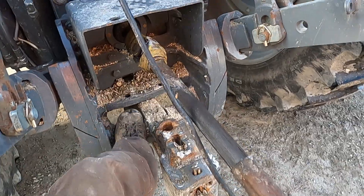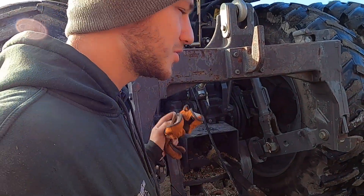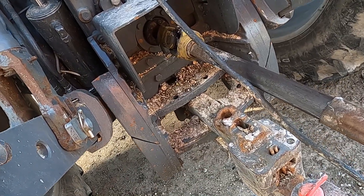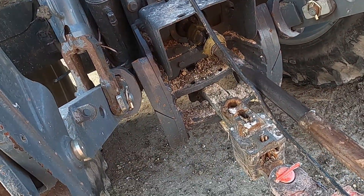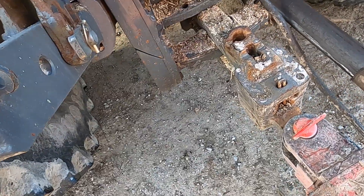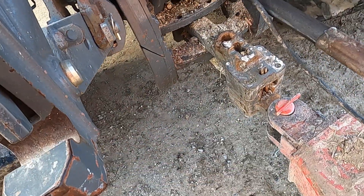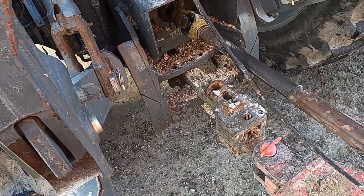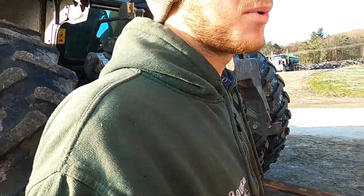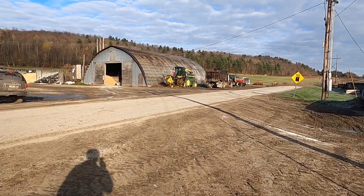We priced it out - Oregon's, they're like 30 minutes, they have two of these tractors and had to do their drawbars too. These are the Cat threes from factory, and we gotta get the Cat four. We thought taking this off there'd be a hole in the center like a normal drawbar, but there's not, so we couldn't just take that off. It's kind of flipped around to work for now - it'll work on the tank, but for next year we'll probably need a different drawbar. That's scary priced - a couple grand for a drawbar.